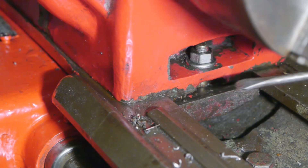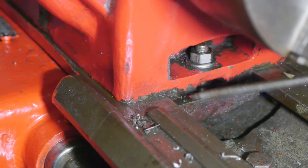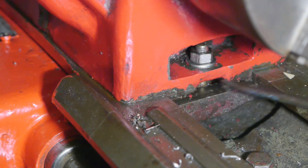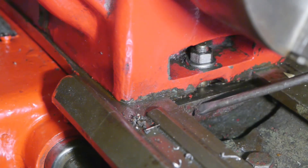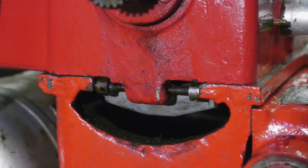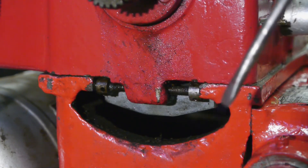Here you can see the headstock isn't sitting on the V-ways — it is mounted to the bed with this clamp, and it looks to me that there is no room for the headstock to move sideways; it is tight against the bed at both sides. The clamp however does have a slotted hole, so it is clearly designed for some sideways movement. This is the rear of the headstock, and you can see that there is some mechanism here to pivot the head.